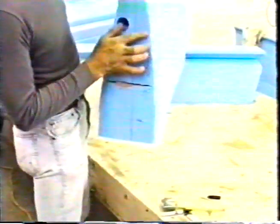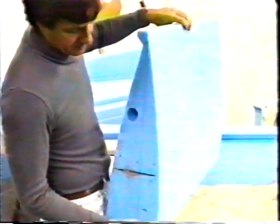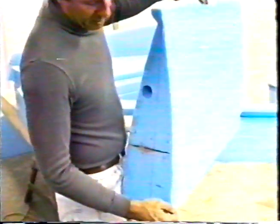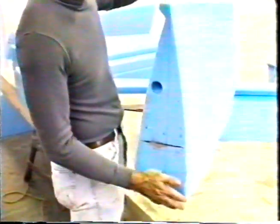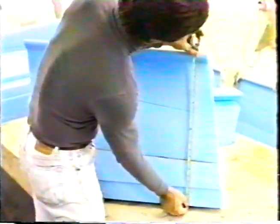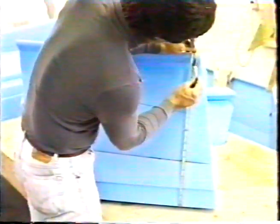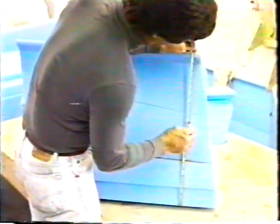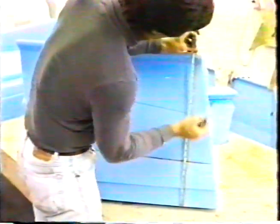This edge, the foam, represents basically a jig upon which your glass is going to go. If you have an edge like this damaged, it won't support well the laminate that you put out. There are ways around this. The foam is going to be removed in this area later anyway, and it's not a terribly important juncture, but do try and preserve the integrity of the perimeter of your blocks. Absolute precision in this area is not paramount. The general rule is 1 inch, 6 inches.